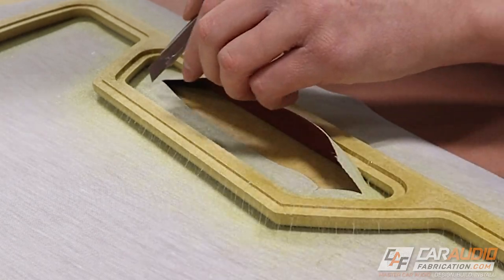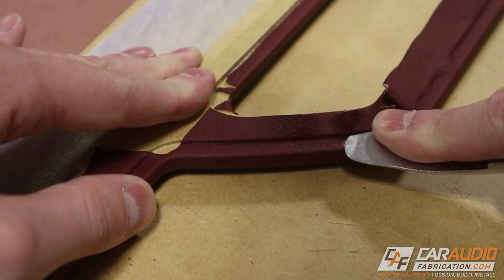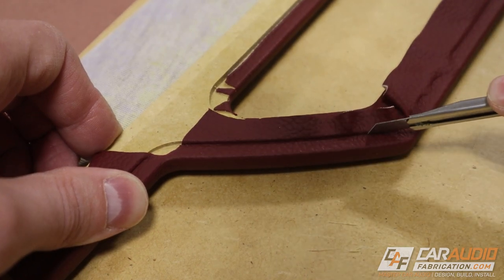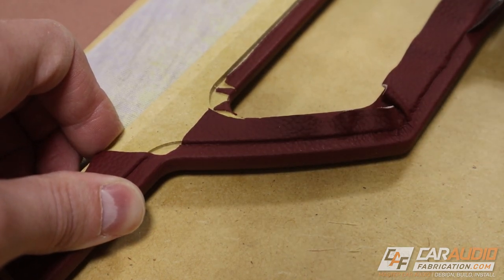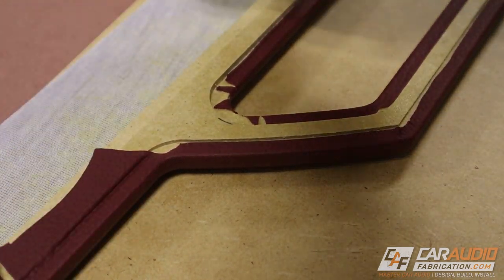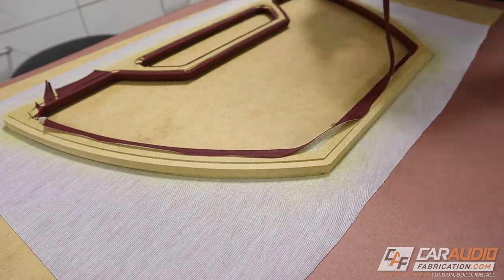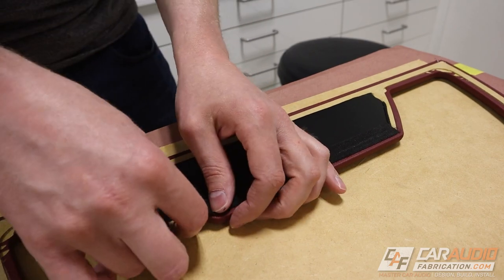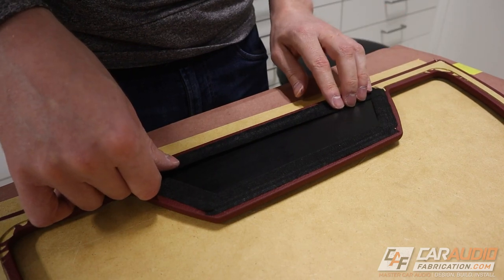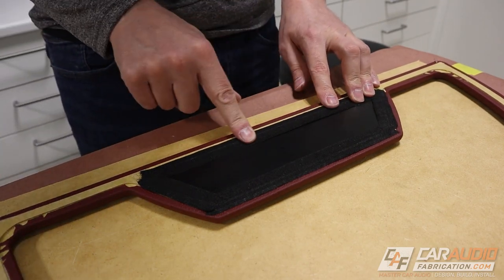The hardest part of wrapping is always these small inside corners, so I always cut some relief cuts before I push these little fingers of material up into the corner and secure them on the back side of the panel. You can now see the reasoning behind adding the rabbited groove that I did in the woodworking process – it gives me a little step to guide my knife and cut the material away. This process is repeated on both the inside and outside of the shape. I'm securing my acrylic logo insert to the back side using some black automotive tape, and I like to do this because this cloth tape has some sound insulating properties that prevent it from vibrating against the top of the box.